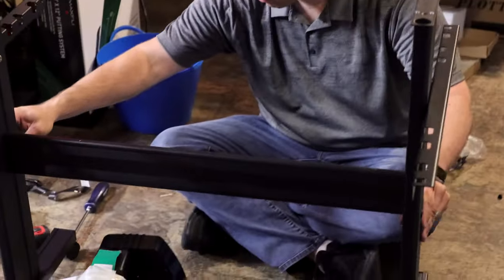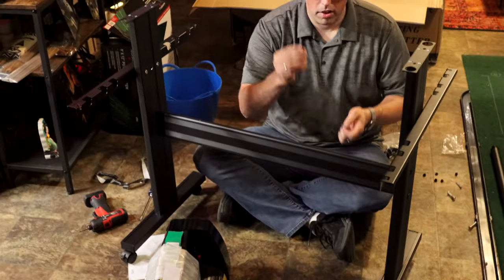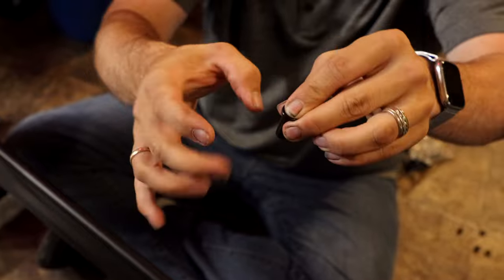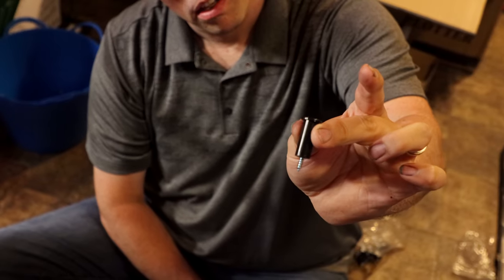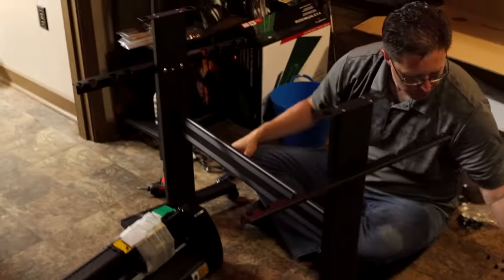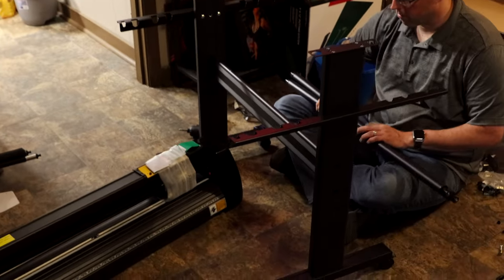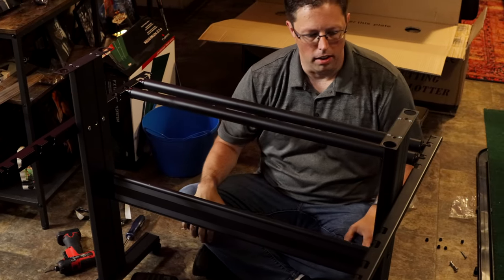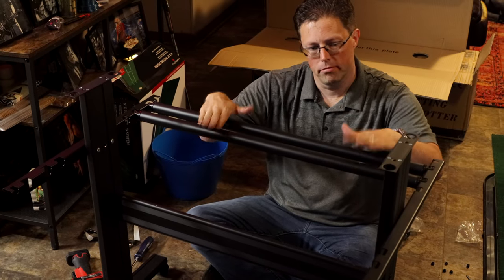You can see we've got the completed stand together. The way this works is it has a recessed button cap, and the screw goes into that same C-channel as before. You have to make sure the screw comes through the hole, which is a little bit tedious, but then you just screw it in and hold the center frame. That's pretty much the frame of the plotter. There are also two rollers — your media holders — that will hold your rolls of material to feed into the machine.